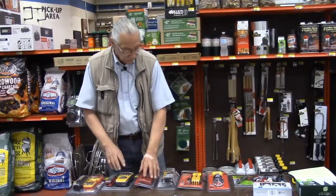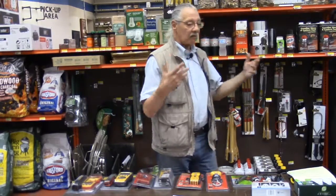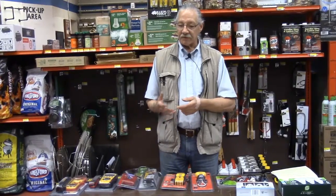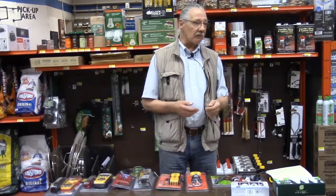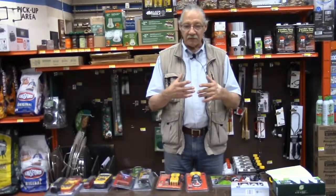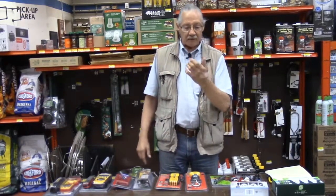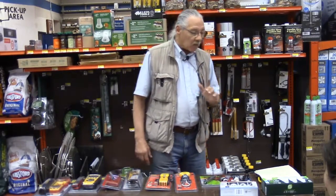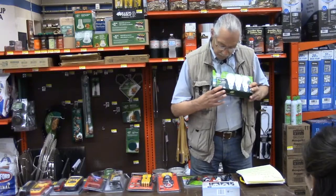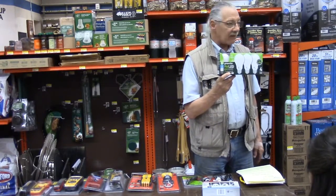One thing I'll mention before we get into the rest of the class: if you're going to be testing dimmers and somebody says their dimmer isn't working — I was on a job a couple months ago where they wanted to replace switches with dimmers, and they had two dimmers that weren't working. I turned the dimmer on, the bulb flashed once and didn't work. I figured I'd blown the bulb because something was wrong with the dimmer. I took the wall plate off, started to remove the dimmer — wait. They had two sconces over the fireplace. I took the bulb out. It was an LED and right on the bulb it said 'non-dimmable.'